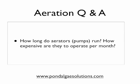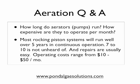Third question: how long do aerators — the pumps primarily — run, and how expensive are they to operate? Well, the main component of the aerator is the compressor or the pump, and many of what we work with are rocking piston systems, and they're designed to run continuously for five years or more. Many run seven, ten years — that's not unheard of — and this is in continuous operation. The good news is that the seals, which are the parts that can wear out most of the time, are easily repaired even by the pond owner with very few tools. It's simple to work with, and generally they run trouble-free for a long time.